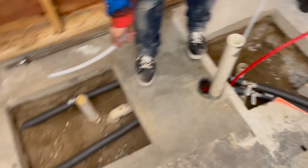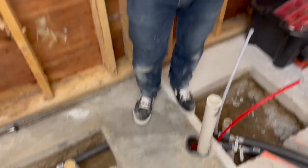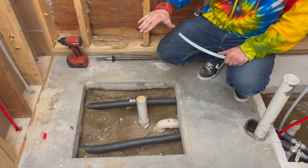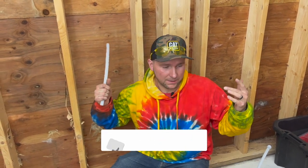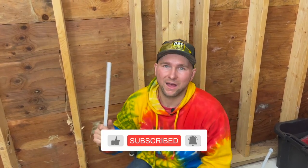To update on the project: our plumbing is basically done. This P-trap just needs to go in — we'll do that tomorrow, then backfill this. Tomorrow we're also going to recess our shower pan because it's going to be a curbless shower. That means we have to take an inch off of the slab, self-level, and then put the pan down. It's a bit of a process, but the finish is really nice and you can charge pretty good money for that. If you want to see how that's done, hit the subscribe button and I'll see you tomorrow on vlog number seven.